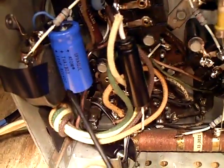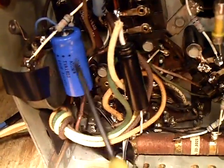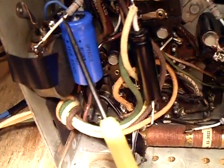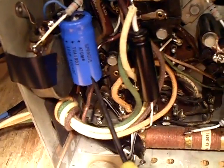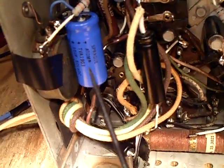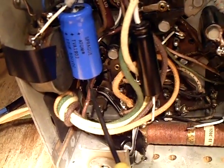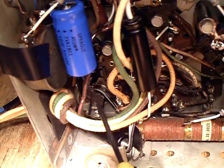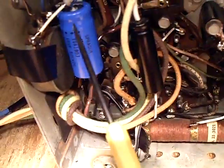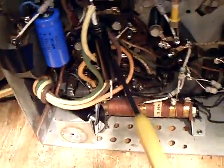These are the electrolytics — I'll use my pointer here to point them out. This is a 10 microfarad and that goes to ground. This is correct where it has the plus going to ground because this is like a floating B-minus system. The middle leg or center tap of the transformer is the most negative part of the radio. So the minus of this goes to the circuit that's part of the center tap of the power transformer, meaning the negative is in the right spot and the positive is actually going to ground. This electrolytic down here and this electrolytic right here are part of the Pi network for the filter.